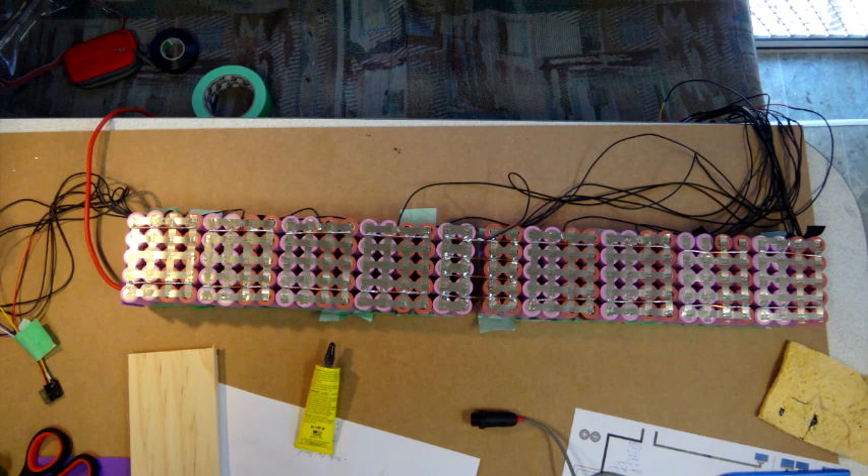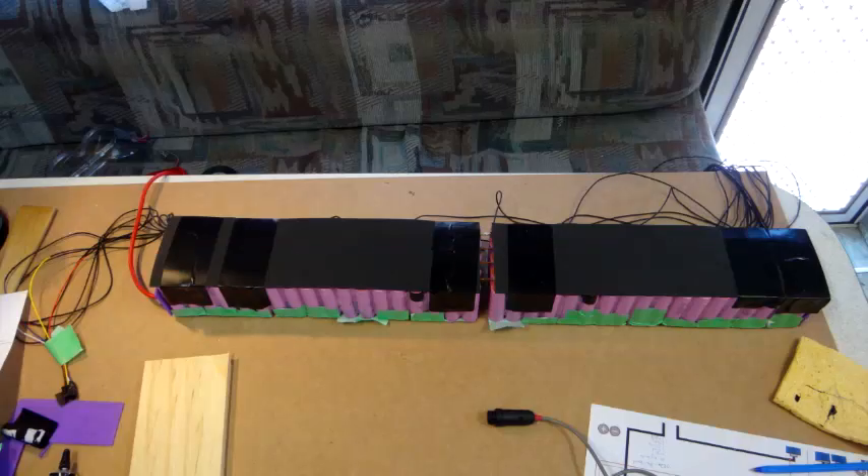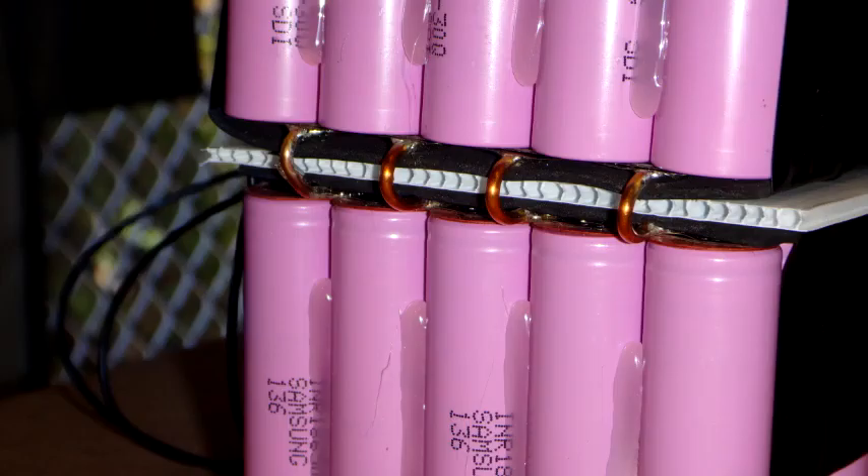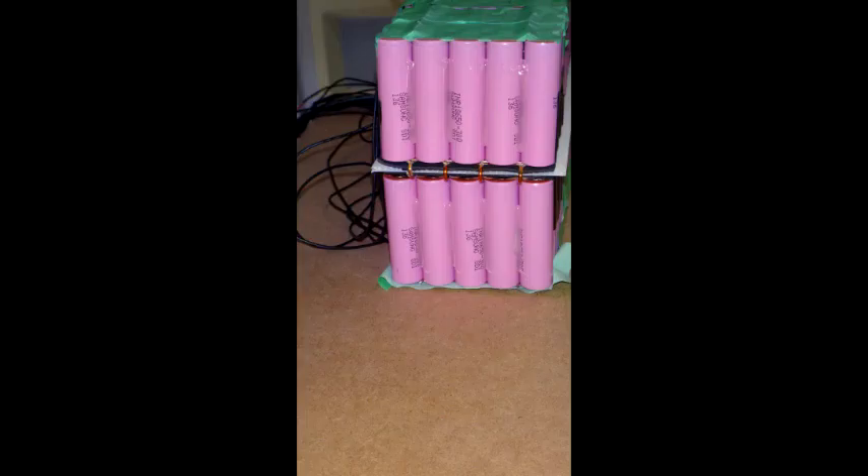At this stage all the BMS wires are on. You can see all the copper trace, particularly joining the two packs in the middle. I've got four copper trace pieces with a little gap, ready to fold the pack in half to form the two layers. Before doing that, I put foam over the tops of the cells to prevent any shorts. I also added Coraflute — basically plastic cardboard — between the two layers for better protection. You can see where the copper traces bent when folding. That joins the two packs in series and provides plenty of room for high current.